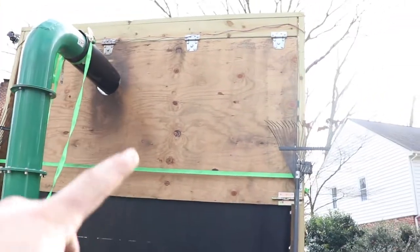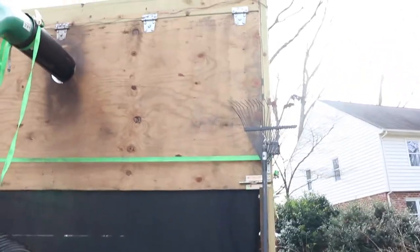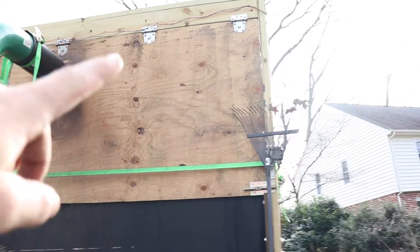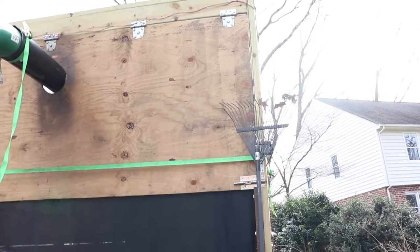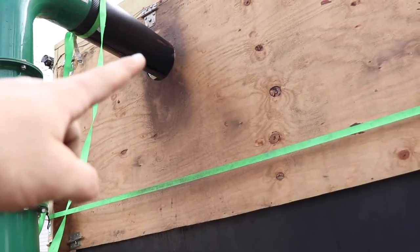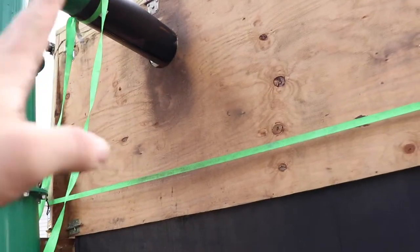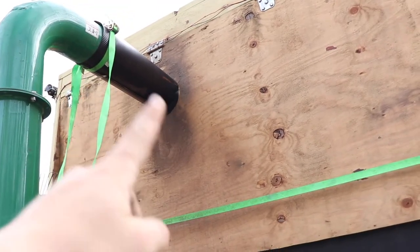How I constructed the back door is another sheet of plywood cut to length to fit widthwise — it's four feet long so it matches up with the side plywood. I took four heavy-duty hinges across the front. There's a two-by-four on the back side of the plywood to help support it. I cut a hole out for the exhaust tube — that's actually an eight-inch piece of stove pipe I ratchet-strapped on. There's about a foot gap it has to travel, which is why the stove pipe is there. On the bottom side of the door I have an 8x10 mesh tarp screwed in to keep stuff from flying back out and to give me a visual of how full the trailer is.